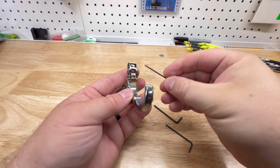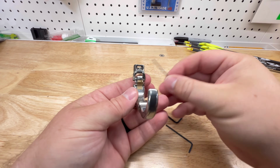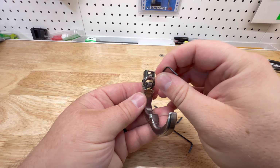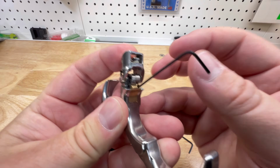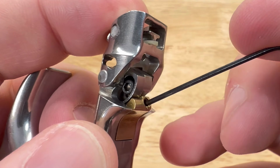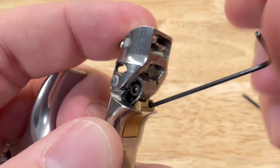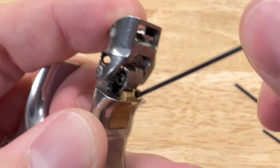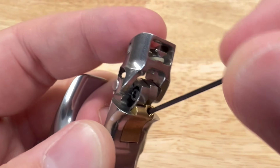We've got the click set where we want it. We've got it locked down on the bottom, so it now cannot move. So we can take our micro drive and now, get up close here, we can drive the fire sear. As we make adjustments on this, you can see if I move that left, it's going to increase that distance. That slows it down.